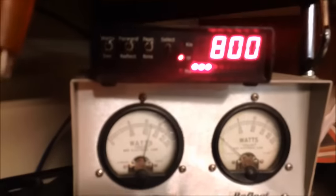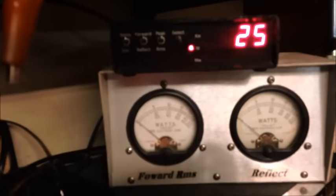Oh, yeah. So those watts are coming at 14.5 volts, which is about what a vehicle would run it at. So not bad out of it. Might do a little bit more in his mobile. You know, automobiles are a little bit different than power supplies and dummy loads and stuff of that nature.